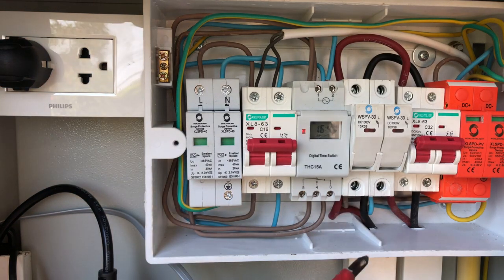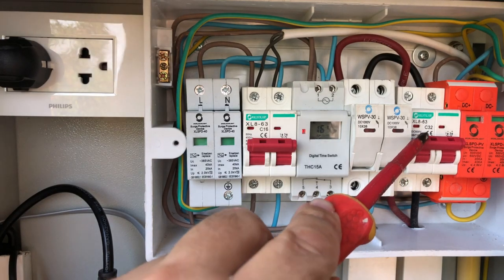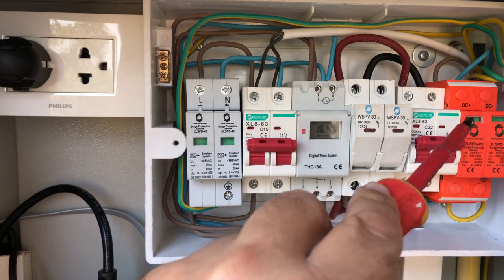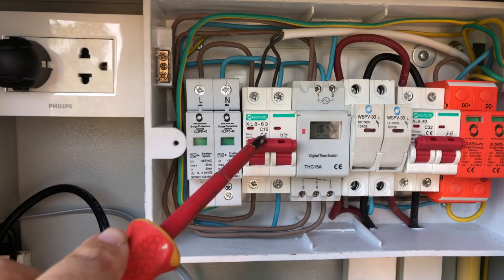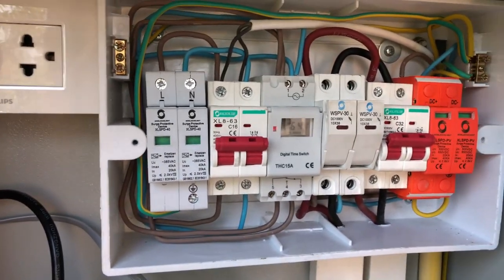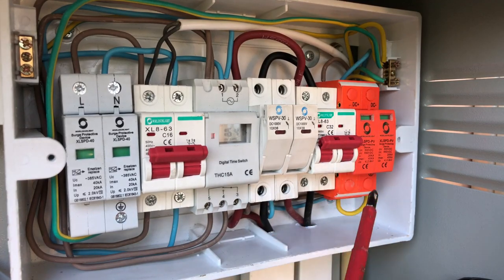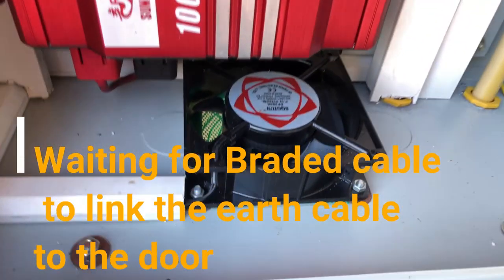There's a lot of safety in here: there's the main 30-amp isolator, the 32-amp isolator switch fuse, two 30-amp fuses on the DC side, surge protection on both the DC side and the AC side, an isolator switch, and a fuse switch — so any problems and that switches it off as well. As you can see, everything is earthed over here, and the cabinet itself is also earthed.